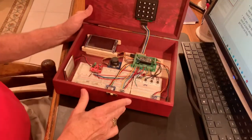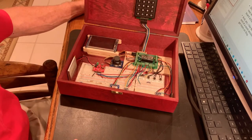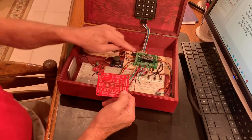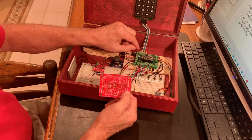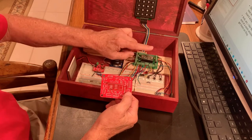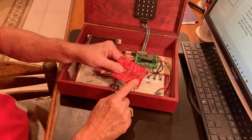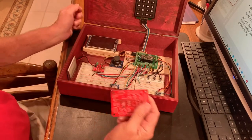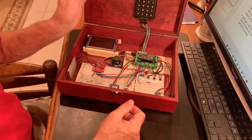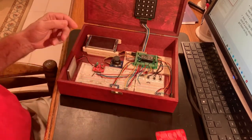So it is, as I mentioned, a duplicate. One of the changes we're going to be making in the rebuild of the controller box is we're going to upgrade the circuit board to a new version that replaces some of these screw connector units, which are great but are susceptible to corrosion and also to loosening. We're going to change it to some JST connectors and other things. Once we build a card, we're going to put it in here, make sure it works, build another card, test that out, and put it into the controller itself. And we should be off and running.